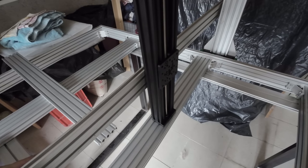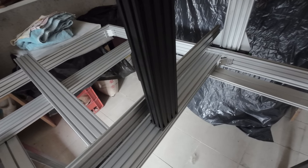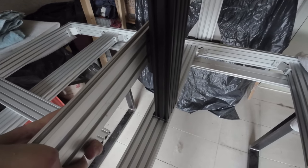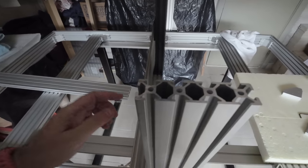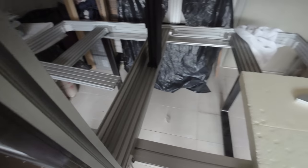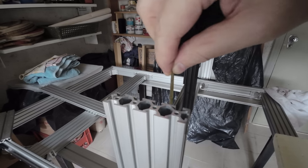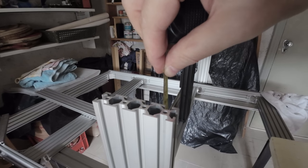So this one is actually going to be reversed. This side is going to be attached to the aluminum extrusion like this, and the entire Z axis will move up and down. Okay, so from here to the plate, which is going to be down here, let me measure. I have around 37 centimeters,